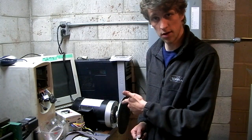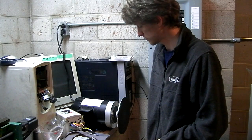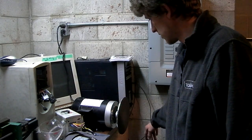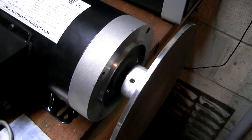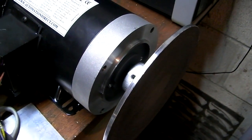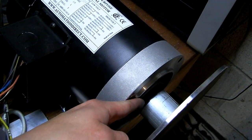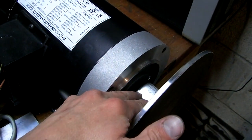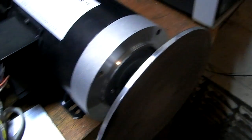How about a quick little update on Project Disc Sander? As you can see, I got it to work. Not perfectly, of course. Being fairly homemade, there's issues. Remember how I had the disc on my lathe and I faced it down? Well, the only way to make it perfectly smooth is either to make the disc and hub in one piece, or to actually take apart the motor and chuck up that shaft in the lathe so that the way it's side clamped is perfectly concentric all the time, blah blah blah. Basically it wobbles.